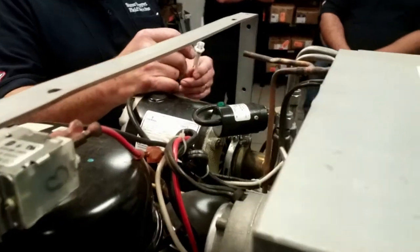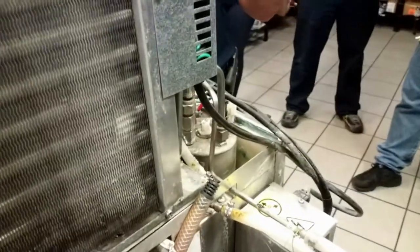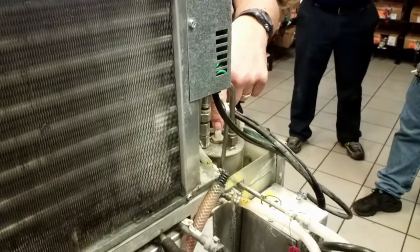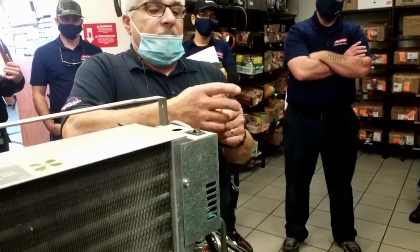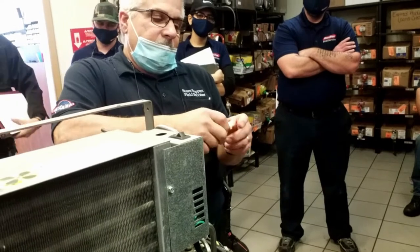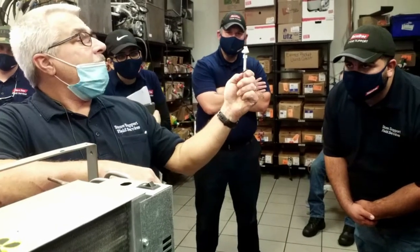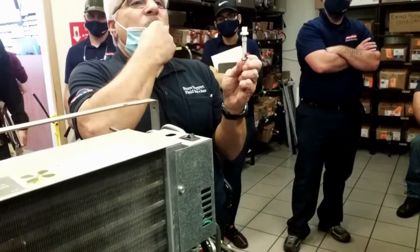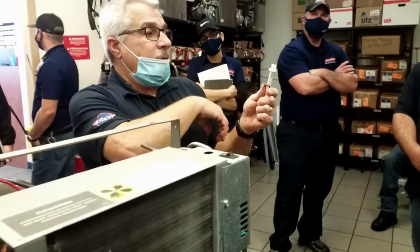So something's wrong with the carbonator. It's not working. You come back here and you take the wire off the probe and it kicks on. You put it back and it shuts off. So there's something wrong in that tank. Could be the probe. That probe was perfectly fine until you look at it a little closer and you'll see that it's split. So what that does is you'll have moisture in there which shorts between those two probes and it's not going to come on.